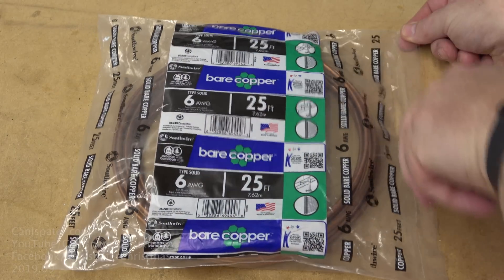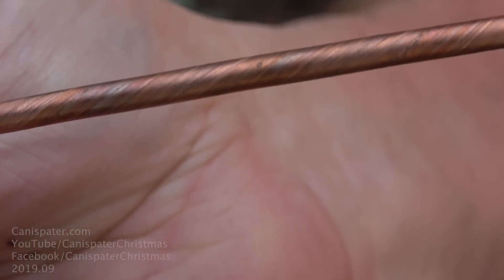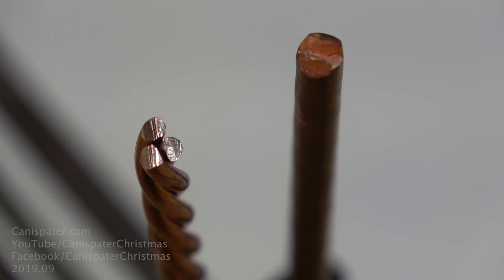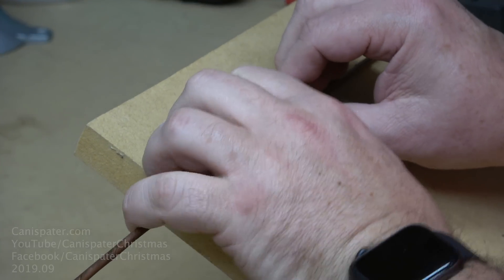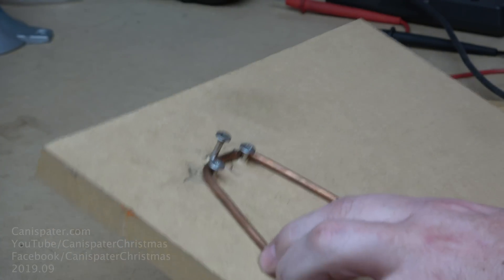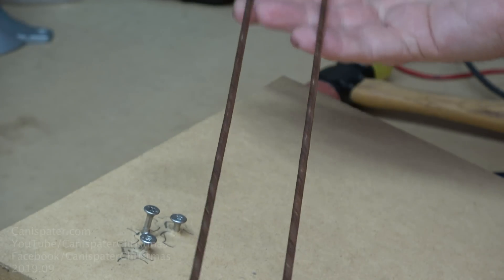I also found this bare copper single conductor six gauge wire, and you use the same process — you just twist it to straighten it out. Here's what it looks like after some twisting, and here's a comparison of some twisted 12 gauge wire and some six gauge solid copper. The solid seems to be slightly larger based on how they went into the small vice I'm using, but they are pretty close. Here's the length of twisted six gauge wire — I want to find the center. Then I'll put a bend in it using a small jig that I built. This will make up a bus bar for one side of one cell pack, so I'll need a total of 14 of these.